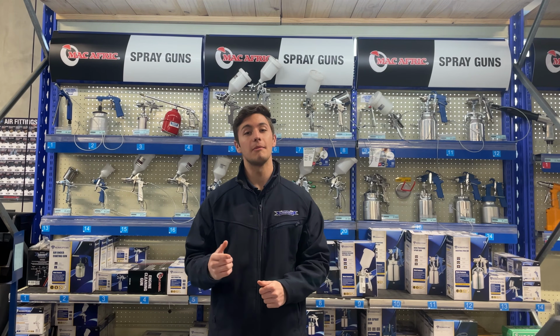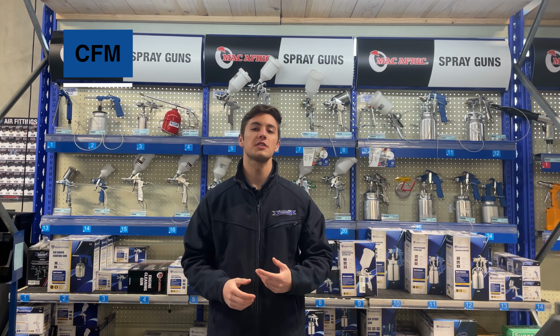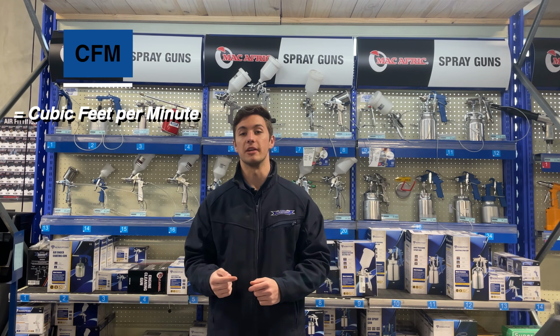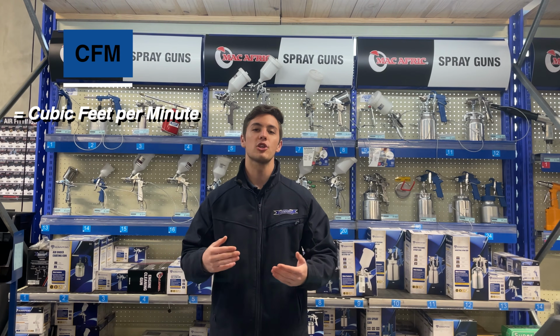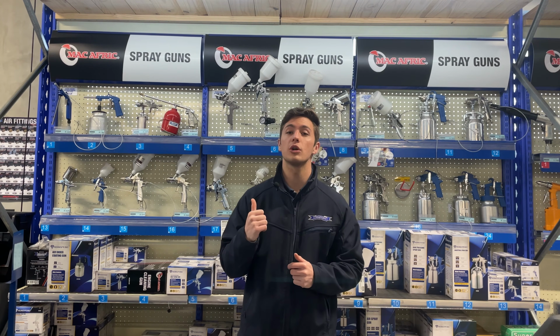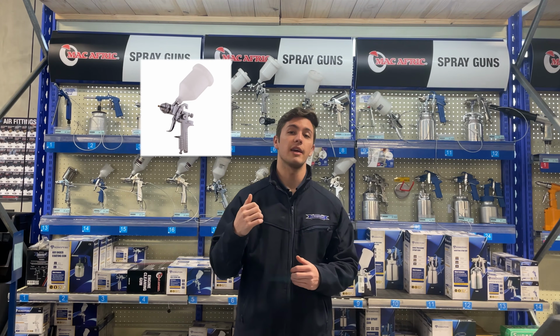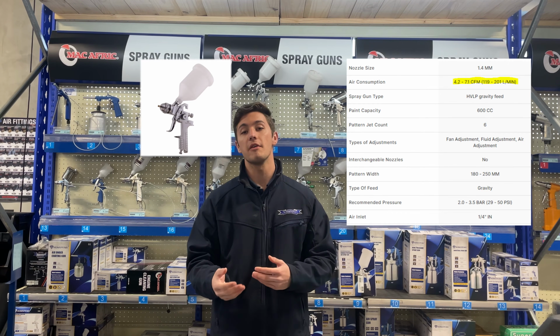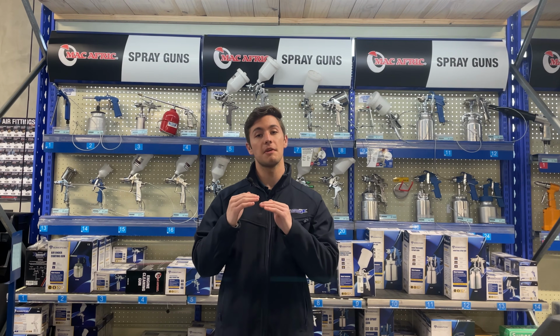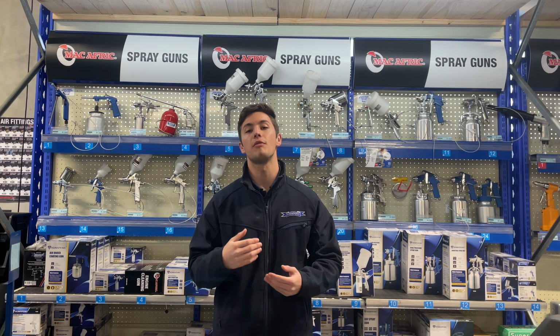So I mentioned CFM a little earlier in the video. You're probably not exactly sure what this is. So it's just an abbreviation for cubic feet per minute. Essentially, it's just how much air your compressor can push out per minute. Now, depending on the tool you are using, each tool has a CFM rating. For example, the spray gun over here might have a CFM rating of 8. Therefore, your compressor must have a CFM rating of higher than 8. If it is 8 or lower, your compressor is unfortunately too small or not powerful enough.